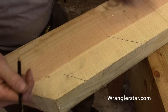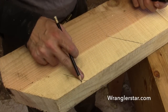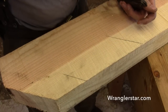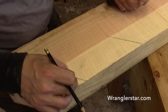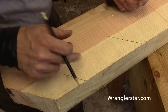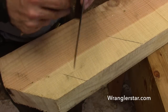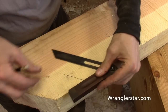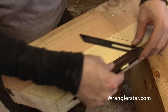What we want to do is let that knee brace in here — in other words, it's going to make a little groove for it to sit in. It'll look really nice, be a really nice detail, and give it some strength. We'll put a nice big heavy three-quarter-inch lag bolt through there to tie it all together. We need to determine this angle here, which is 45 degrees.